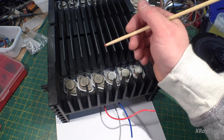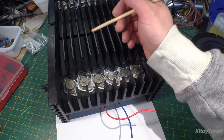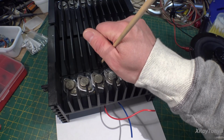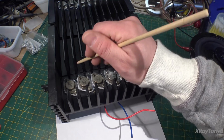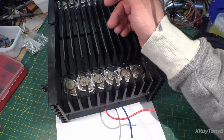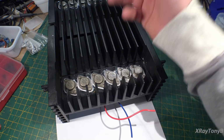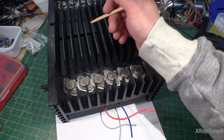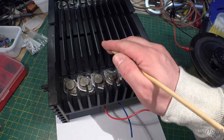So again, I thank you all for listening, and I thank you guys big time for catching me on that. I did not catch that those 2 driver transistors were only 4 megahertz transistors. That would have kind of defeated all the purpose, and I probably would have been patting myself on the back for how good I did, because it doesn't go into oscillation, when probably it may have been, who knows, I may not have even fixed anything, but by putting those transistors in, who knows.